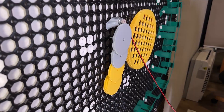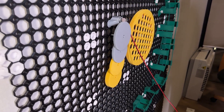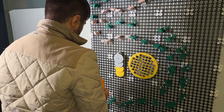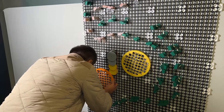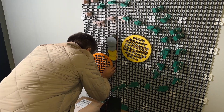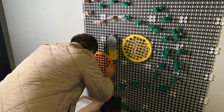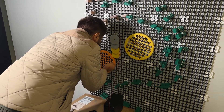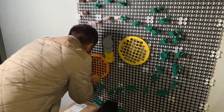And again, problems. I messed up — this time with geometry. Multiboard hole spacing is 25 millimeters. For gears to mesh properly, the tooth count sum needs to be divisible by 50. And 240 plus 80 is not divisible by 50. In theory, it shouldn't work. But let's ignore math again — it keeps ruining things. A random discovery helped, or as they say, trial and error. I tried different holes around the big gear, and one worked — diagonally. And it actually looks even better. I'm so proud of myself. So I kept this diagonal layout for all the gearboxes.